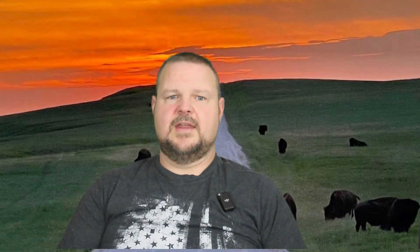In order to rectify this situation, I had to unscrew the clamps on the counter so that we could scoot the fridge out. Then I had to get a pigtail with a 90-degree plug so it would fit behind the fridge and the fridge could scoot back right into place. We use one of these external on/off switches, which I really like. That plugs into the pigtail — the pigtail is needed so that it sticks out to the side of the fridge — and then we just plug our RV fridge right into this thing. Whenever we want to turn it on and off, all we gotta do is flip it right there.